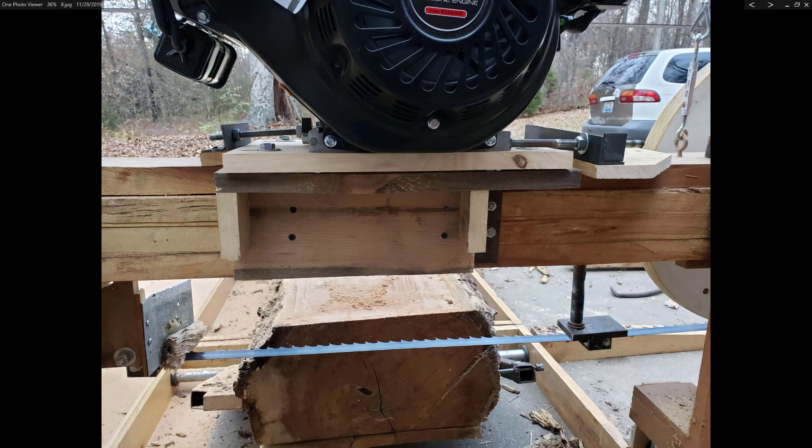Here are the jack bolts underneath to adjust tension on the V-belt. You can see this one on the left — about a couple hours after this video, it broke off the drywall screws I had holding it. I'll need to set it up more like the one on the right, where I've got a gusset welded in place and a much larger board that spreads the force over a larger area. It's a jack bolt on both corners to keep the motor from twisting, since I need a couple hundred pounds of belt tension to fully utilize the C-size belt.